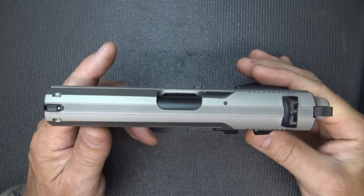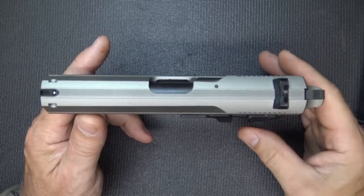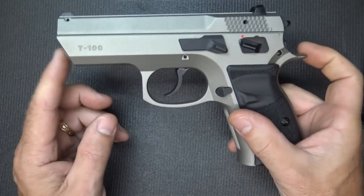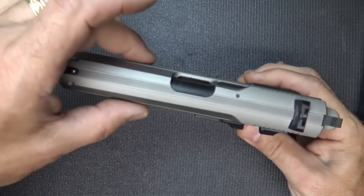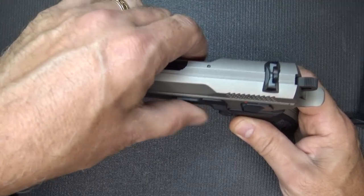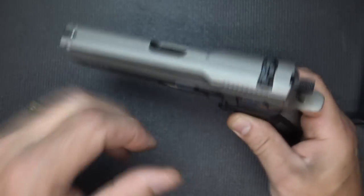The barrel is 3.7 inches in length. Now, according to even the TriStar box, it says 3.9 inches. But I measured it, and that was the length. It's 7.3 inches overall, and the slide itself here is 1.03 inches, so it's a really thin slide. It gets to 1.3, or about a 1 1/3 inch, with your controls right here, which is typical, but being